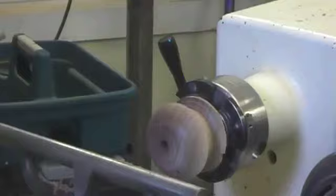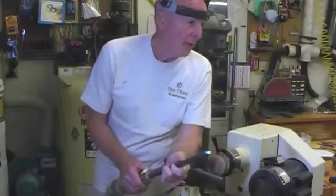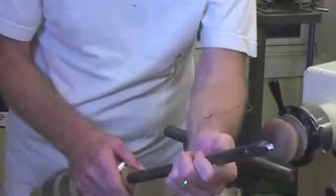And all this is a three-quarter inch bar, right? With a hole in it that'll accept a quarter-inch machine tool bit. And you can shape the ends of the machine tool bits however you want. These things are very nice for doing small details on spindles, and they're a lot cheaper to sharpen than a regular turning tool. And you can create all sorts of different shapes.